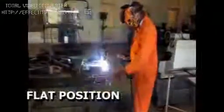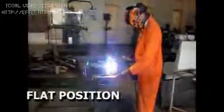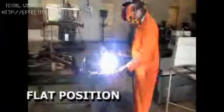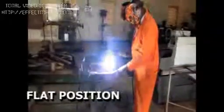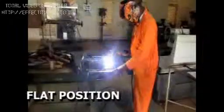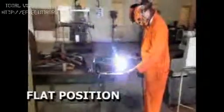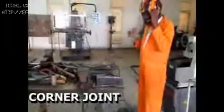Protected. Continue welding. That's welding in a flat position. Look at the hands, the welding table, the level should not be up to your elbow. When you concentrate, you watch the puddle ahead. Look at the puddle and we weld, and then we stop and we lift up the helmet. You see the work properly. And that is flat welding which has been done.